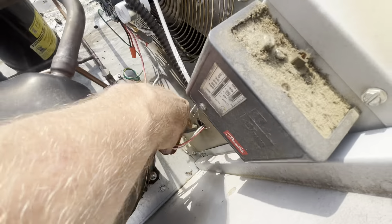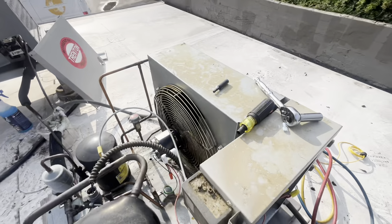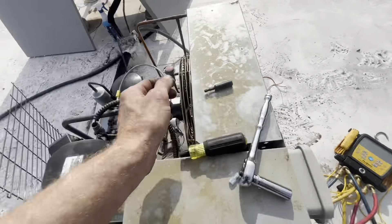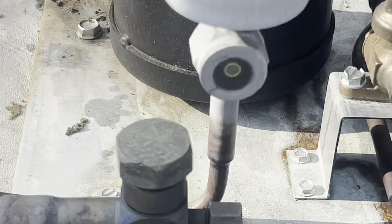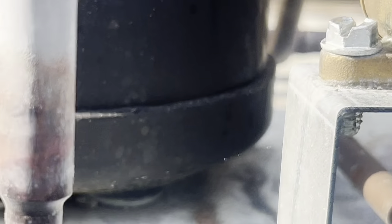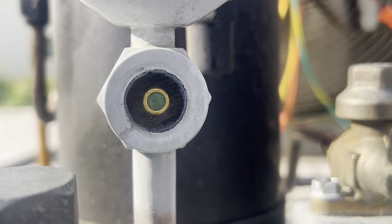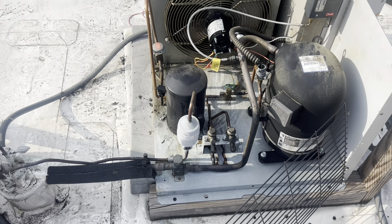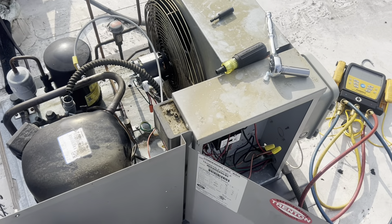We're dealing with 240V, so let's look at the wiring. Orange is line two. Black and red get insulated together. White is line one, and yellow gets insulated. Then you have this separate yellow-to-orange connection which controls your rotation. So black and red together, then yellow. My orange and white lines — I have enough wire to just run them straight through, put new terminal ends on them, and connect them. Moment of truth — looky there. We've already done the rotation properly, which was counterclockwise from the shaft end, so we're drawing air the correct way.